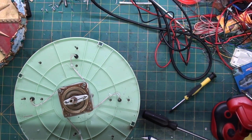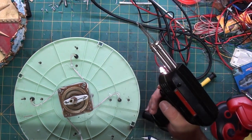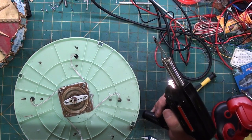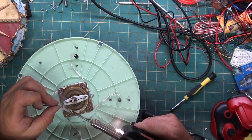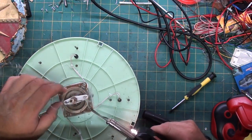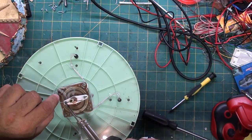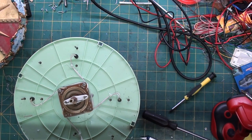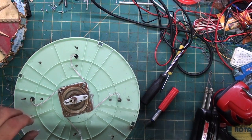Soldering iron out, something that works fast and gets real hot. So I'm going to use an old Weller's Expert soldering gun. These take just a mere moments to get hot, as you can see by the smoke. Very good. I'm going to re-wet the solder so that way it comes off easy. This is a trick, because sometimes just heating up original solder doesn't work. Voila. Just a matter of seconds, and it's done.